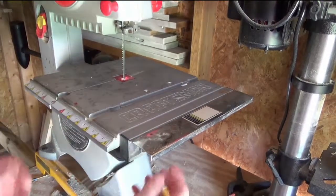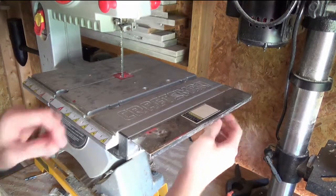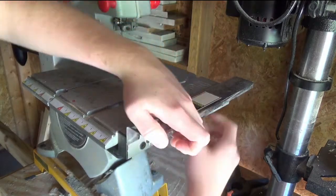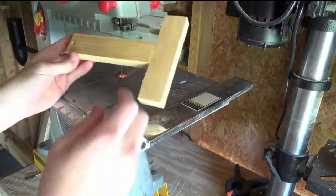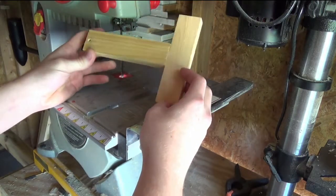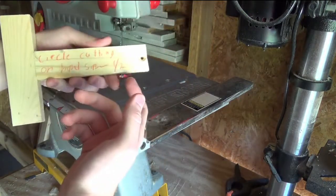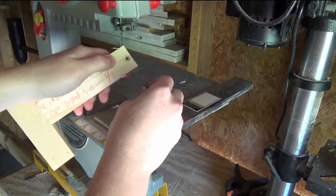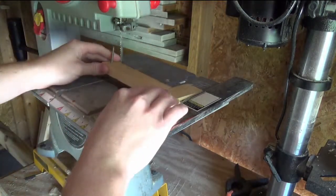For building a goblet, we're going to start here on the bandsaw. How I figured out how to do this is we're going to raise up this little bar over here and make it into a fence. I have this fancy little piece of wood, which is just some 1x2s — I believe they're both pine. I've got two screws in here to make sure it's sturdy, my label on here because it is a jig, and a countersunk hole that I drilled with the drill press. I take this big bolt, slide it through — it's flush — and now I have a pin.